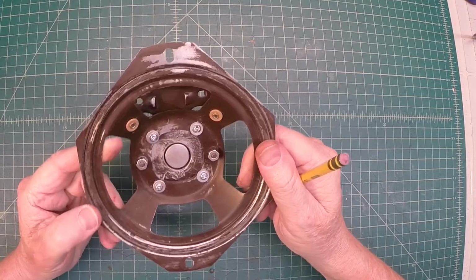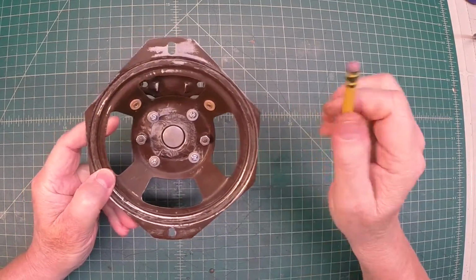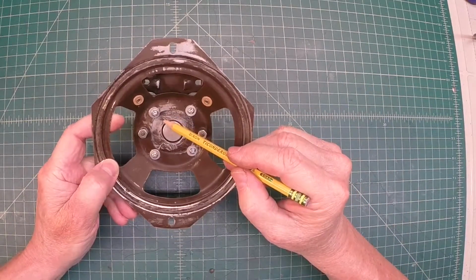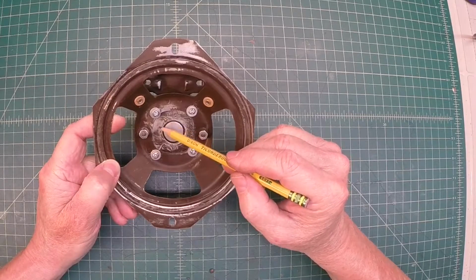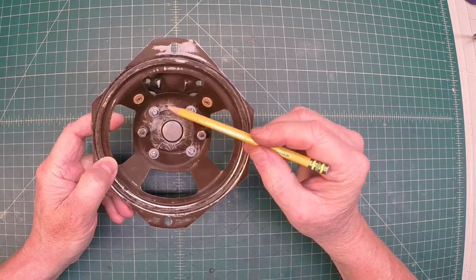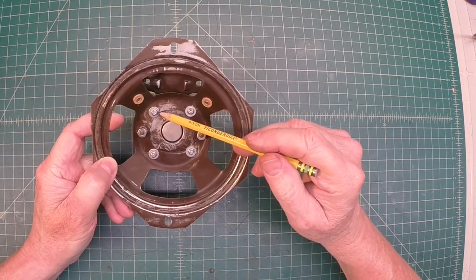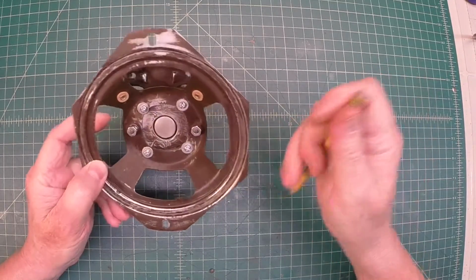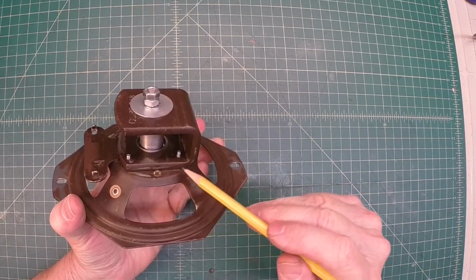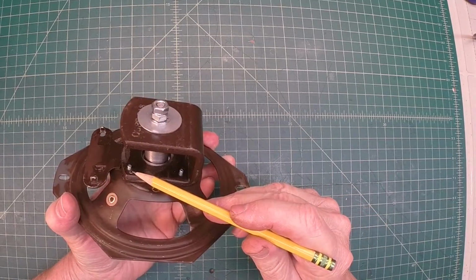Before I wind the coil, here's a look at the speaker frame itself, and these are the modifications I made. Before, I had these little stubs coming up from the field magnet assembly, or what I referred to as the yoke for this center pole piece, and you can see I've drilled 4 holes in using some number 6 screws.